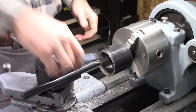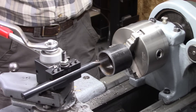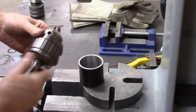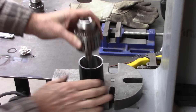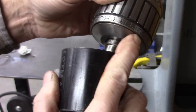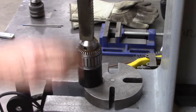I want to make sure I'm not going to run into my chuck jaws there. To get this apart, open the jaws all the way, or at least until they're under the surface right here. Set it in your pipe — see if you can get it close up there — just pressing on this part of the chuck only. You can leave the taper in or you can remove it; it's easier just to leave it in.